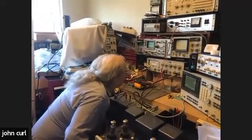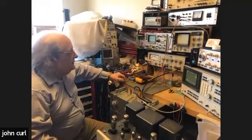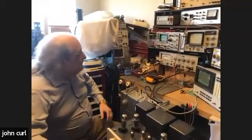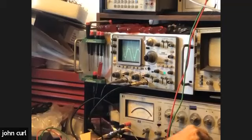I better make sure I'm down enough. I think I'm okay now. I have to set the levels again because this is a different power amp, and its actual voltage gain from input to output is different than this little guy. Okay, here it clicked on. You can see that the input level has come up. Okay, now I'm going to go back to 3 volts and set this thing to about where it was before. And John, what amplifier is that so people know? A JC1. JC1 Plus.